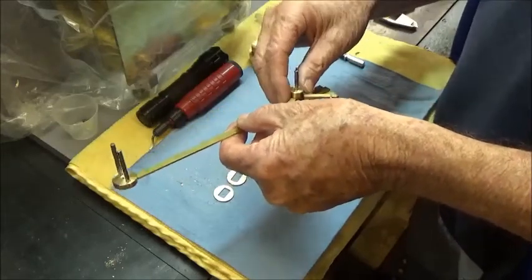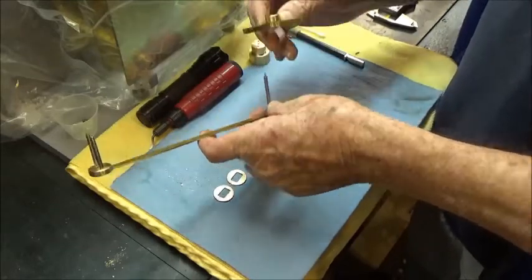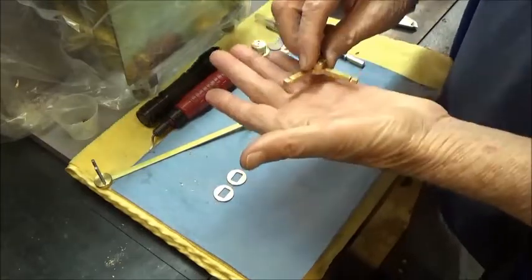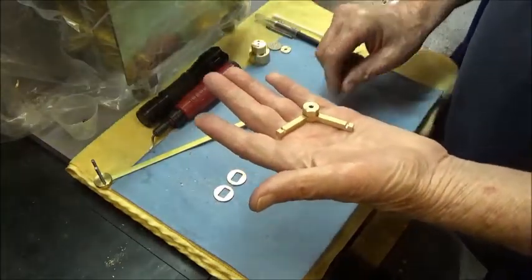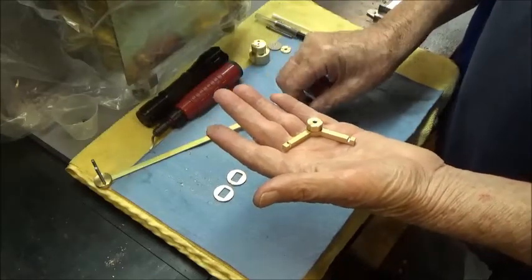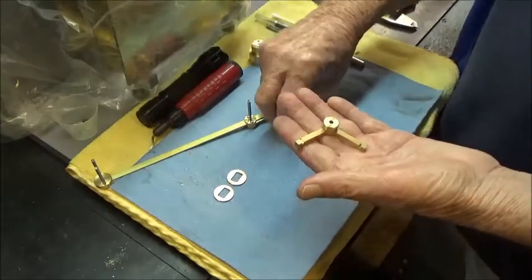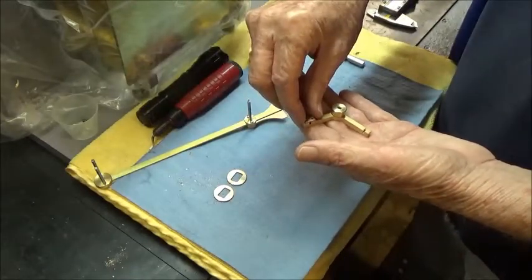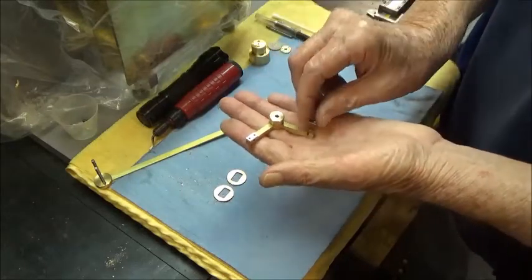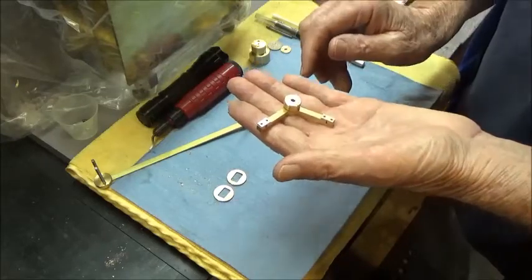this is the pallet arms right here, and I'll slide those off the arbor. This is the pallet arms that we made, and these are the little tiny pieces that we just finished that hold the pallet nibs in place. And there's some teeny tiny screws that attach these to the pallet arm.